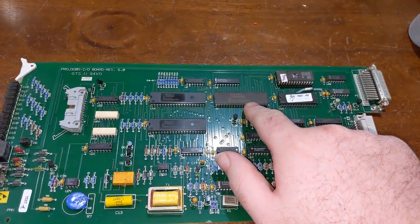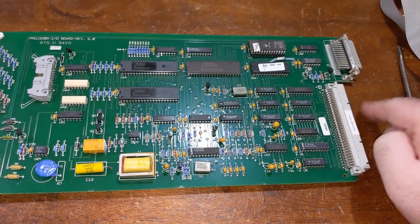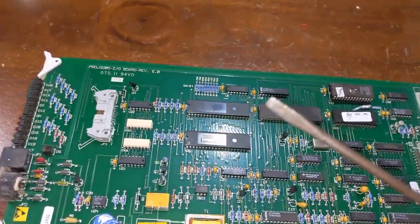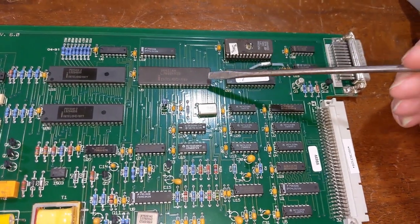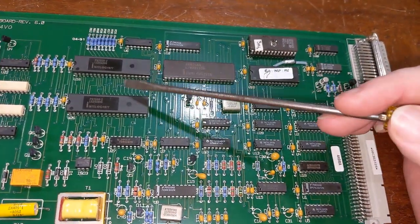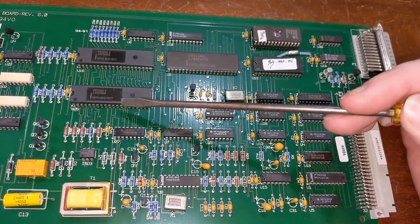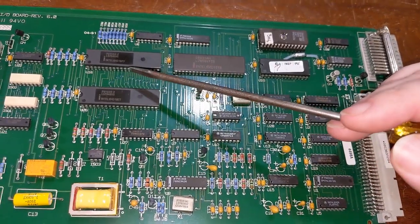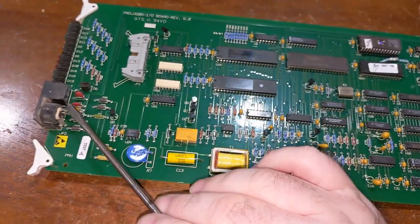The 8051 CPU talks directly, bit banged, across the 68K bus. Anyways, so we have our ROM here, the 8051 CPU. We have two programmable I.O. controllers, PIO, so you've got a port A, port B on each one, along with some internal SRAM, as well as timers. Now, this also has a modem.